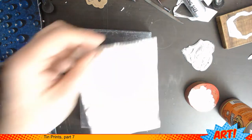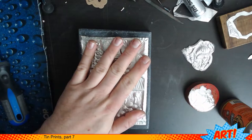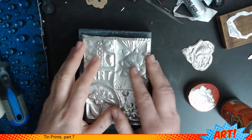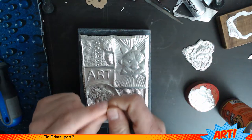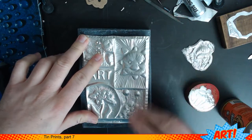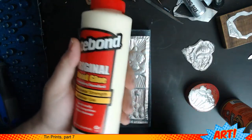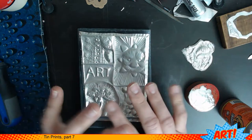Now onto the glues. There are dozens of adhesives out there. Sometimes simple works the best, sometimes it doesn't. I've gone so far as to use two-part putty epoxy — it comes in a tube, you rip off a little hunk, knead it to an even consistency, put down a bead, and press it down. It will hold because it's an epoxy, just in putty form. That being said, wood glue — nothing wrong with wood glue. Just put it on and it will stick to the back side of all your stuff and work fantastic.